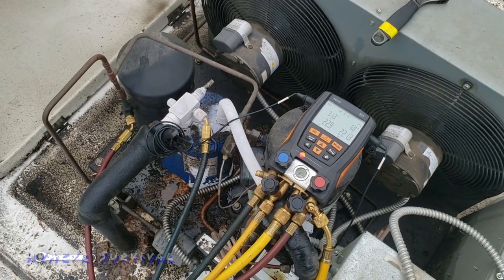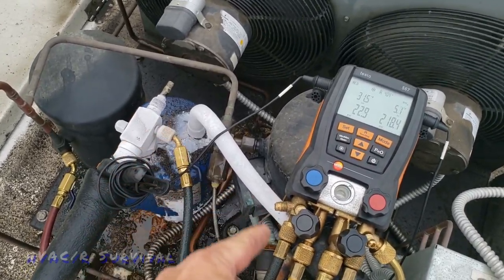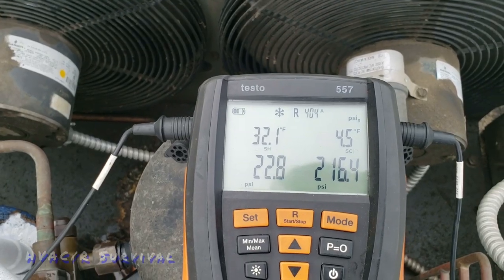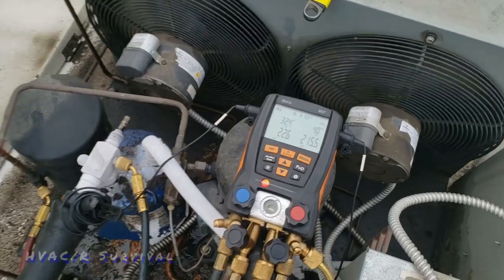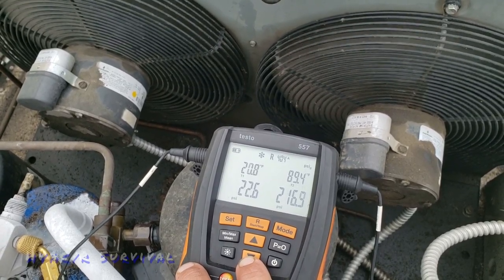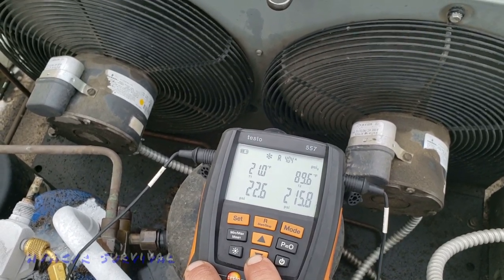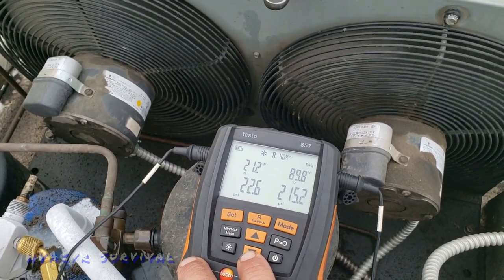Here's a good example of what would appear to be flood-back with refrigerant going in, and now we've got ice coming back to the compressor so to speak. But the superheat is not showing that - humidity levels and the temperature of that pipe have a lot to do with it. That pipe is running at 20 degrees, and because we're fairly warm today at about 70°F with humidity probably around 60%, that's going to freeze on there.